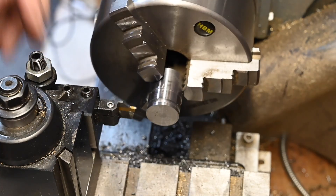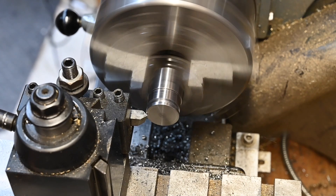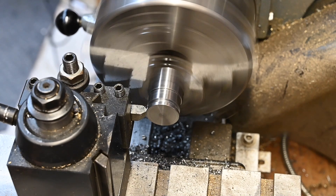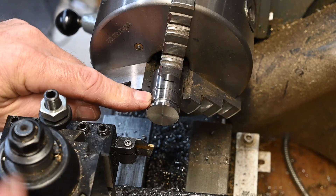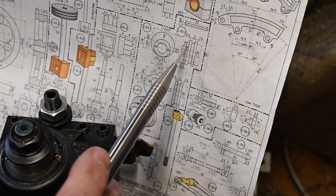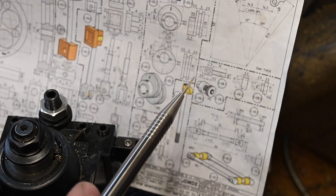The groove is 2.98mm — put some chamfers on there. I'm just going to mark over now the full width including the piece that we've got to put back in and turn down. I'll put a mark on, take it out, cut it on the bandsaw, put it back in, just clean it up, and then we can get on drilling the holes.